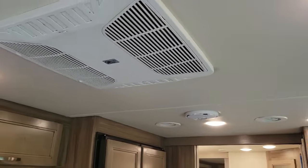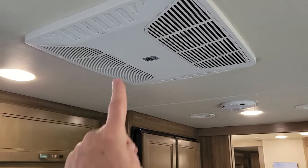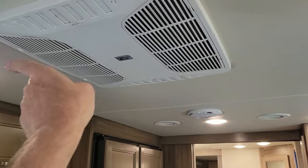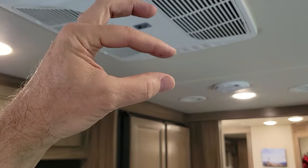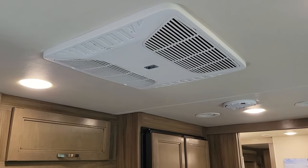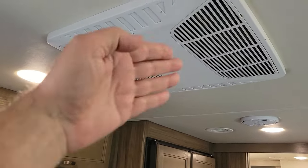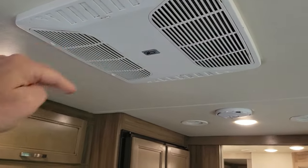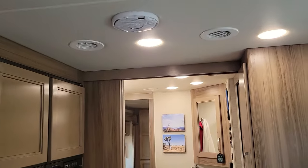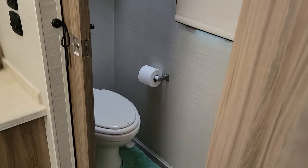The AC duct diverter was a mess up in there, especially the holes going into the ductwork. I had to completely clean those up - they were only about this big - and re-tape them all. There are lots of YouTube videos and forum posts on this, but the angled diverter sends air smoothly into the two duct runs and it really increased airflow from the air conditioners.